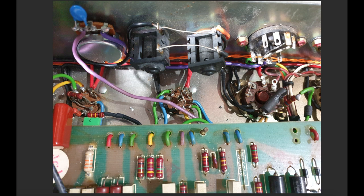And you'll know that when I talked about this in the schematic review, I ended up moving it to the 8-ohm tap, which is this green one over here. You just move that purple wire across to over there. But what we're doing here is off the impedance selector. Here's our 1 meg linear pot. This is a 4.7 nanofarad ceramic cap. I'm using a ceramic this time, just a slightly different sound. And this is the negative feedback line that is going to the amp.